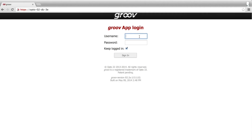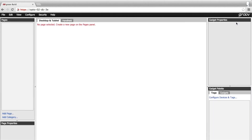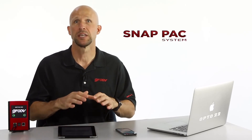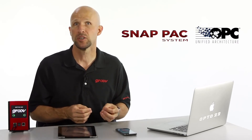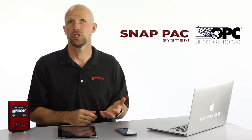Don't forget the S because we're making a secure connection to the server. I've already created an admin account, so I'll just log in here and then click the gear icon in the upper right. I'm in build mode. The entire build environment is right here in the browser tab. In this quick demo, I'm going to create two gadgets: one attached to a control system directly in the room and one from an OPC UA server which is connected to a PLC here in the building. So let's set up the tags for each of those systems now.